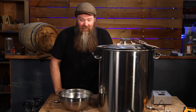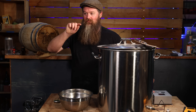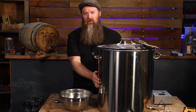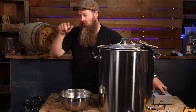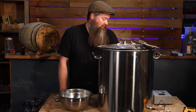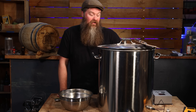That's probably why it's not working. Then I remembered that the last time I'd used this controller I decided to figure out how to use it and messed around with a bunch of different things. I found out that they have a temperature offset or calibration built into it, which is pretty cool. You can calibrate it — put water in, get it to a certain temperature, check it with a known thermometer, check what it says on the controller, and put an offset in so the number on the screen is actually true. I guess when I was messing around I had set the temperature offset to the extreme.